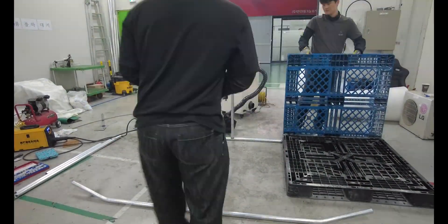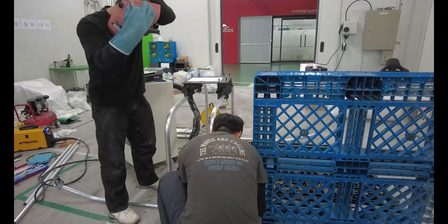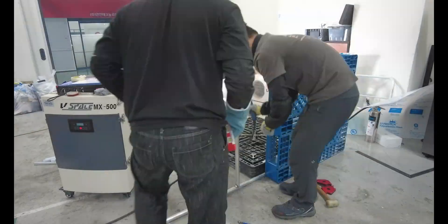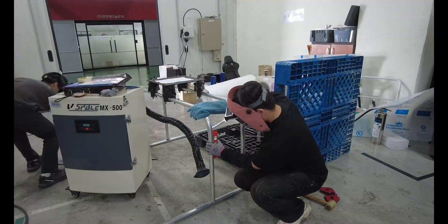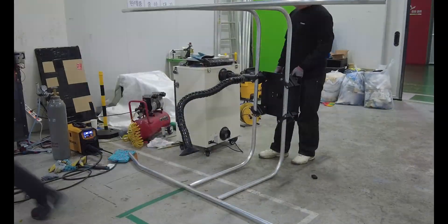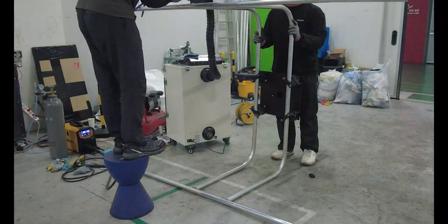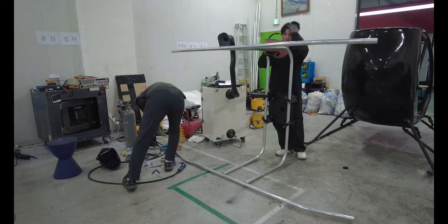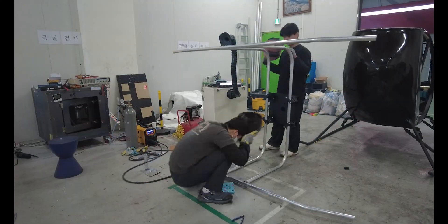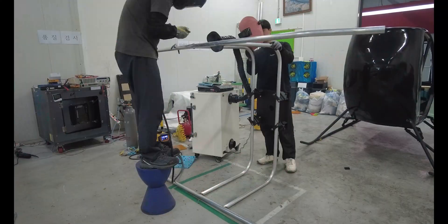At first glance it doesn't look like much — just a few aluminum pipes and plates. But here's the scary part: if I mess up even once, everything's ruined. People say just follow the drawings, easy, right? Reality is absolutely different. Even getting a perfect 90-degree angle with pipes is pure hell. If the pipes slightly bend, if the cut isn't perfect, your whole frame twists down the line. That's why I measured, marked, and remeasured like 10 times.